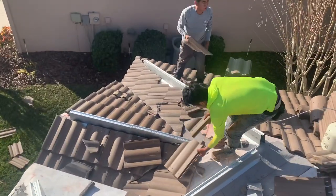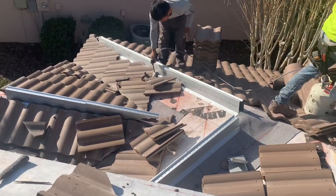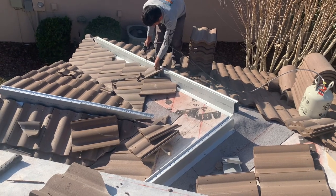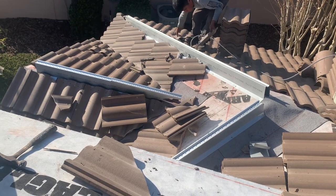He's going to be installing the foam in a layer also on top of the tile that goes below, so that when he puts the piece in, not only is he sealing it at the base, but he's also sealing it on top of the tile below. This prevents the wind from being able to lift it and damage the roof.